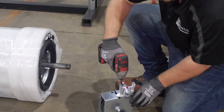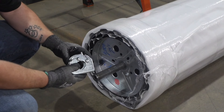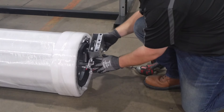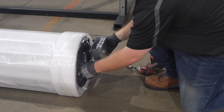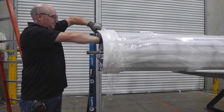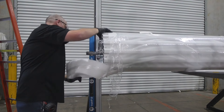These screws will be tightened against the axle later. Slide the cast axle support bracket over the axle. If installing a push-up or electric operation, use the stamped axle support bracket on the drive end with the arrow pointing toward the wall. In preparing to lift the door assembly, remove the green foam on the ends but leave the other materials intact. This helps for easy centering of the door curtain.